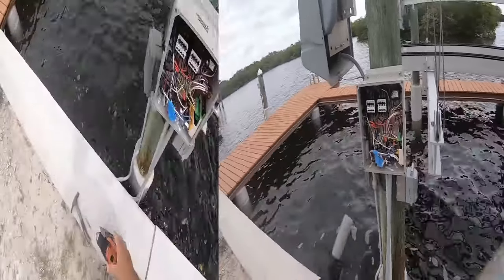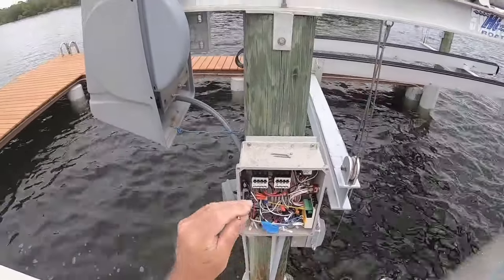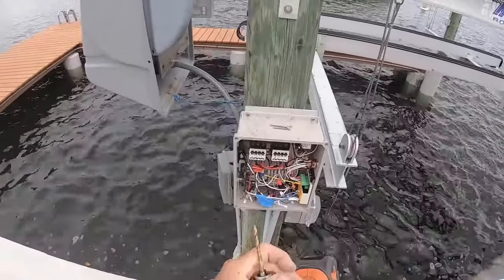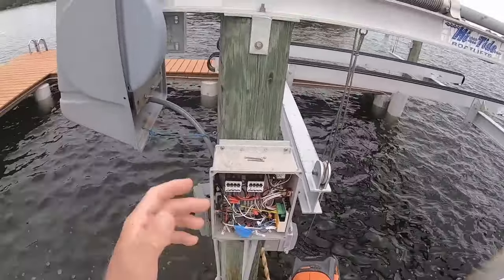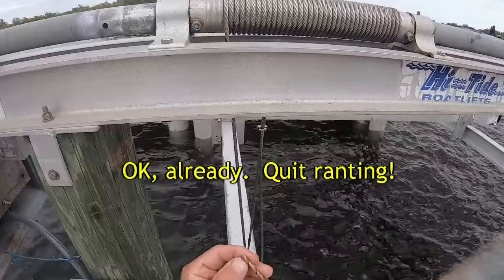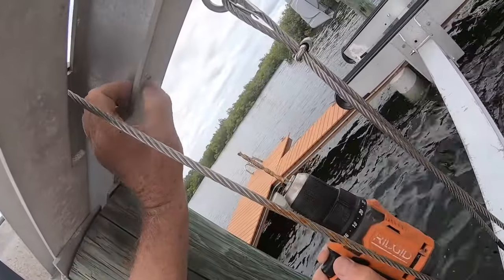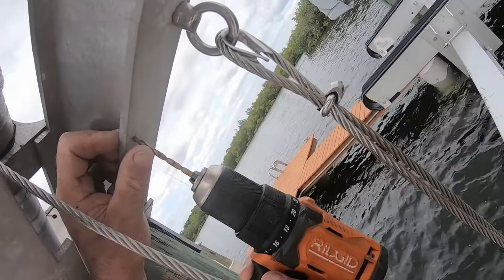The drills that come from places like China and whatever, they're all for shit. They're never ground properly for cutting. So I just sharpen this. Hopefully it'll work. I do them all by hand. But there's a certain way that, I mean, I have a lot of experience. I worked in the automotive industry for a long time, so I know a lot about tooling, and I made this by hand, sharpened it by hand, but I don't have a machine. But anyway, what I've done is I made a square line across here so that I can mount the switch properly, and then I marked two spots and drilled them with a punch.